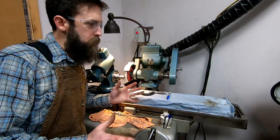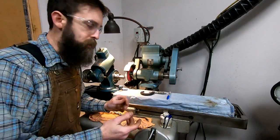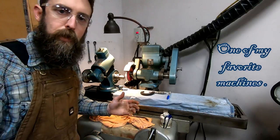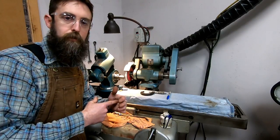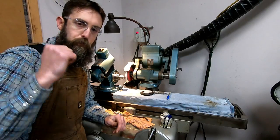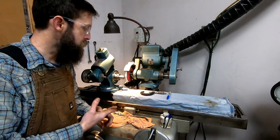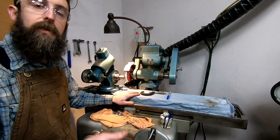Alright, so I'm finally getting to use my grinder again, and what I need to do is reduce the OD of this piece that I've got in my spin fixture here by 2/1000 of an inch. This is going to be an arbor. It goes through the center of my 1.25 inch milling cutters for the horizontal mill and holds them while I sharpen them on this machine. So I need to reduce this by 2/1000. It is 1/1000th over 1.25 inches, and I need to be 1/1000th under.